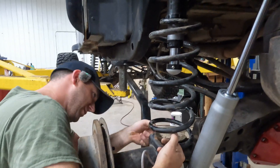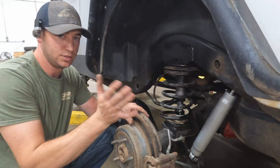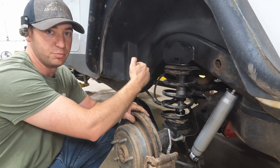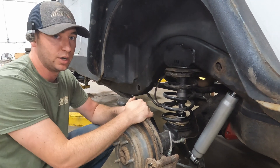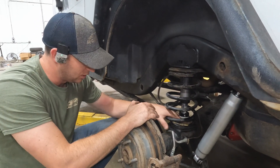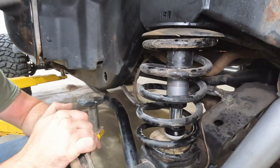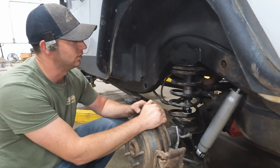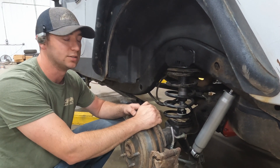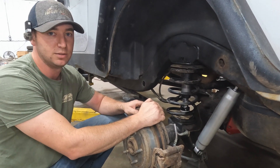Stay tuned to see if Travis's rear main seal holds up and if he buries it in the mud again. The spring is sitting so much better than before — we had a huge bow in it. With our design you shouldn't lose or gain any ride height. The bump stop is centered, offset back just a hair for a clean landing pad, and we've got our one-inch gap right where we want it. Only thing left is to get the wheel on, get it on the trailer, and go wheeling. We're heading up to Gilbert, Minnesota — the Iron Range — to put these to the test. Thanks for hanging out, like and subscribe!